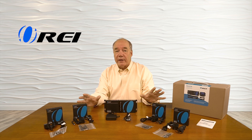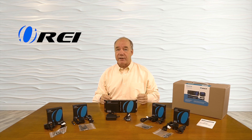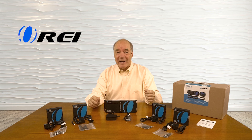And there you go — all four of them up. It's one single input with distribution to four different outputs that can be up to 395 feet away. You can use the infrared blaster kits as well to receive remote control signals from these locations and send those back over the same LAN cables to the primary location, where it'll rebroadcast those signals to control the media you're watching. This kit provides a very simple way of sharing any HDMI media source with four remote locations up to 395 feet or 120 meters away over a single Cat5, Cat5e, or Cat6 LAN cable, with full support for resolutions up to 1080p and infrared blasters included. Everything you need to get started is included and with a few simple connections you can be up and running in no time. Thanks for watching.